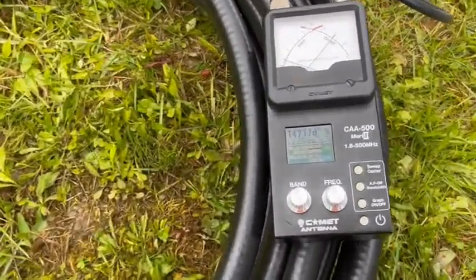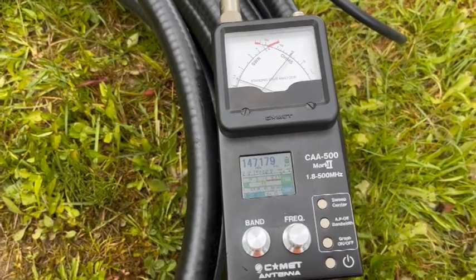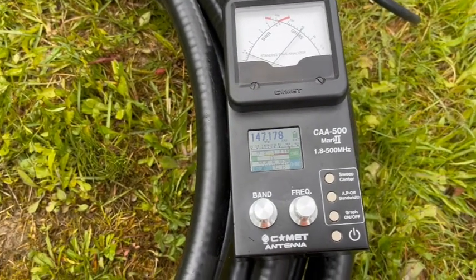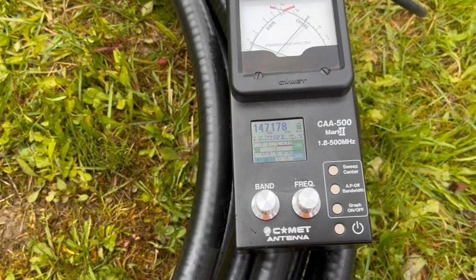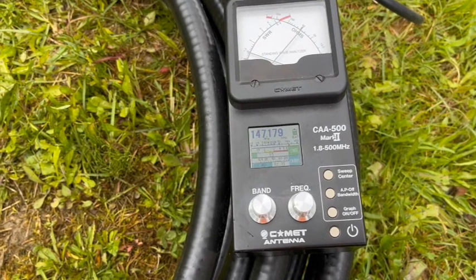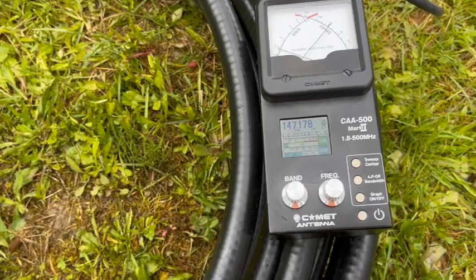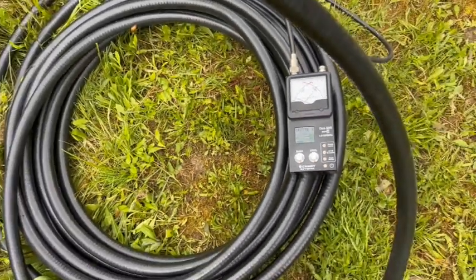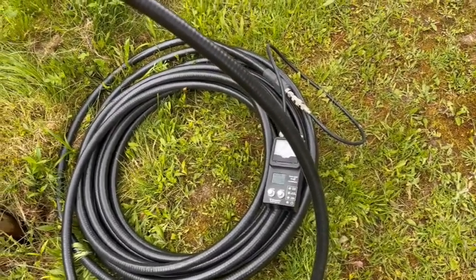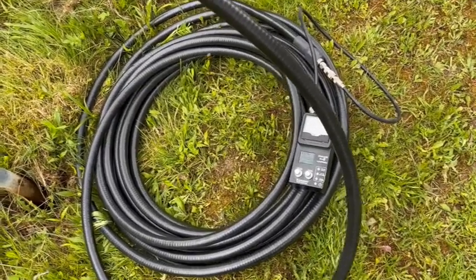This is a dual-band antenna, and pretty close to the repeater frequency we've got a 1.5 SWR — that is pretty good. So I know that when this antenna goes on the tower, everything was good here. If I put it up, check it again, and the SWR is through the roof, then we've screwed something up somewhere and we'll have to figure it out.